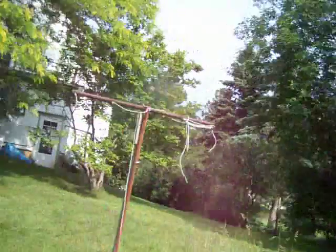So, let's go downstairs to the timer, and I will show you what I have so far. Here is the timer, or the controller. It's a Rainbird ISA 304, bought at my local hardware store, True Value, which was way too expensive. This model was made before the better ones, and it's more expensive than the better ones. But anyway, you can see here are the connections. I don't have a battery yet, but I will get one. Here are your terminals for 4 zones and a common, your fuse and your AC inlet.